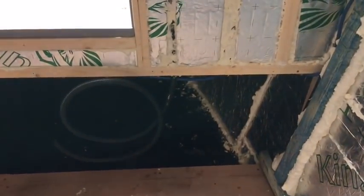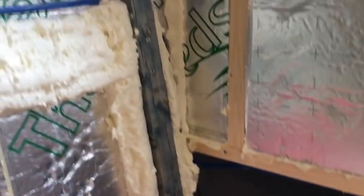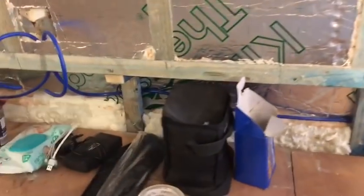I mean, I have run mine in a ring. You ain't got to, you can run it in a radial, but you can probably see that I have put a little bit of 12 volt cabling in as well. This is for the lighting circuit. I will go into more detail on that in the next vlog, but this was the job today. So the 230's in, as you can see, and then next week we'll look at the 12 volt circuit.